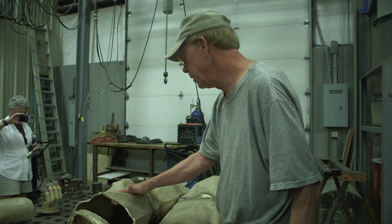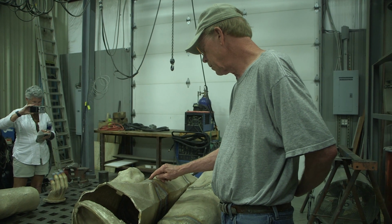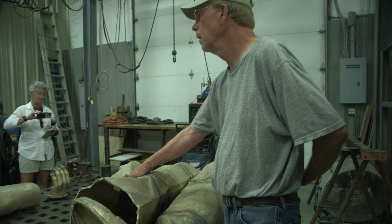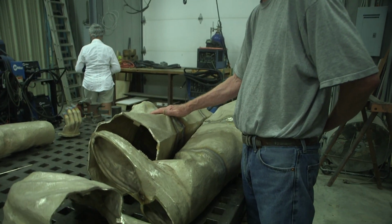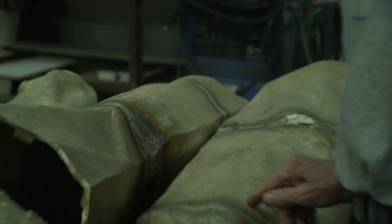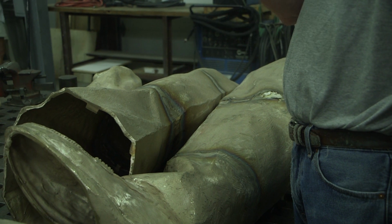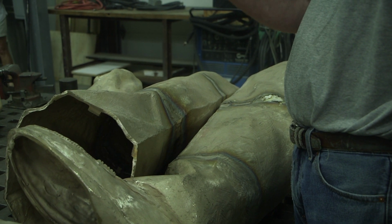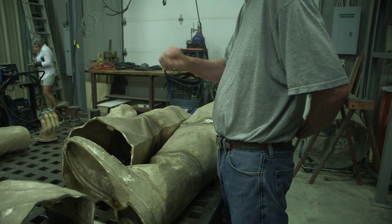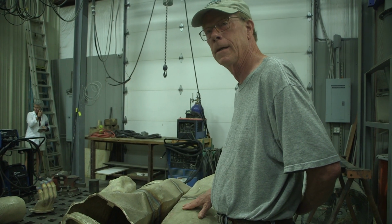And you don't see much here because this is a matte finish on the metal, but before they start doing the texturing, they'll take a powered wire brush and buff all of this area up so it shines, and then they'll take a Sharpie, and where they see the clay rake tool lines go through, they'll draw in everywhere that should be depressed, and then use carbide cutters and bit by bit cut all those black lines out that they draw in so that everything is seamless in the appearance of everything.